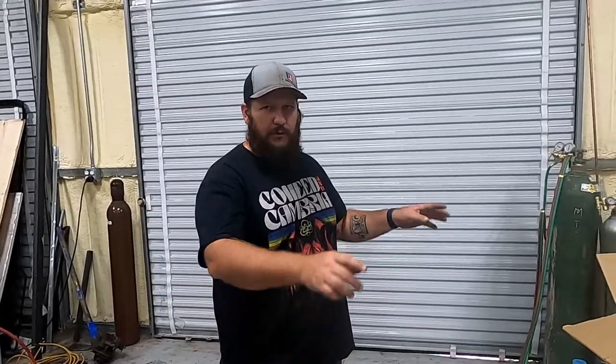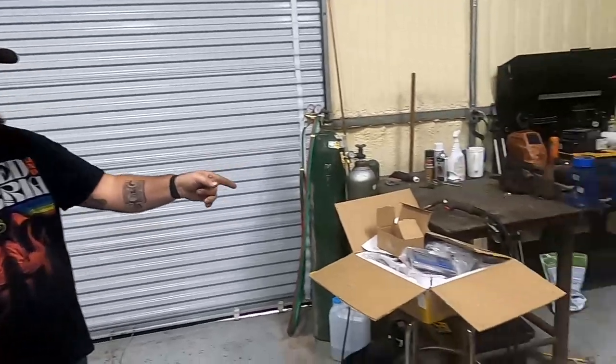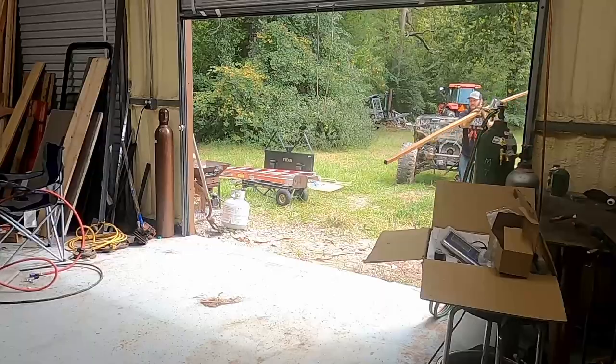We're gonna make the outer frame. Then we're gonna use some cattle panel. I think we're gonna weld some cattle panel in there instead of fencing it out. So we're gonna do that. It'll have the bifold doors on either end of it. And then we will weld our scale tab to the bottom and then bolt the scale feet onto it. So we're gonna go grab some tubing and we're gonna get started cutting.